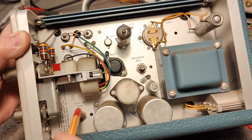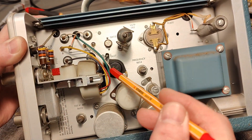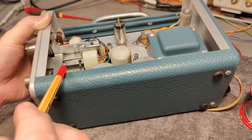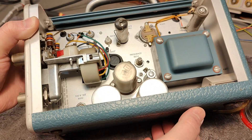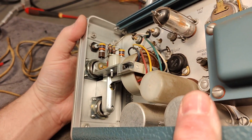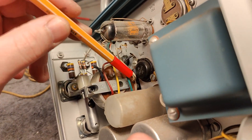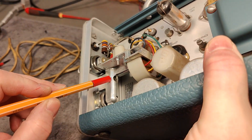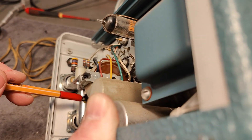Frequency can be adjusted right there. 100 volt set point. All these wires for this part — that is probably the mercury switcher. And in here... oh, look here! Maybe here it is. So this is the magnetic activator coil, right there, with all the feedback and drive and whatnot. And then the magnetic field goes in here, and down there is the little mercury switch somehow.